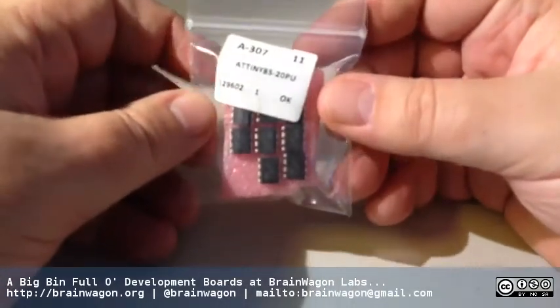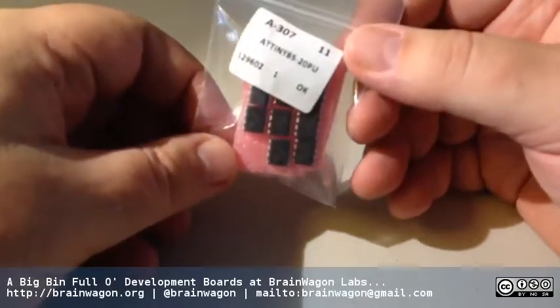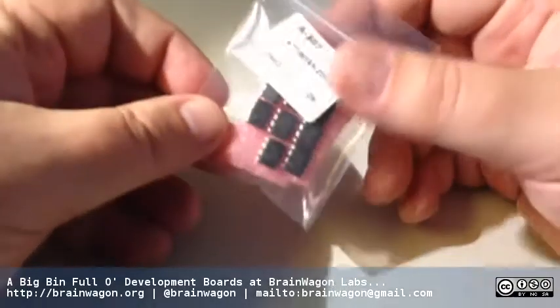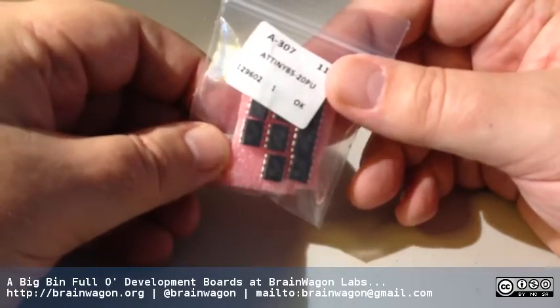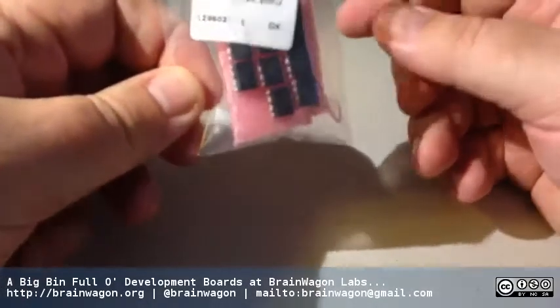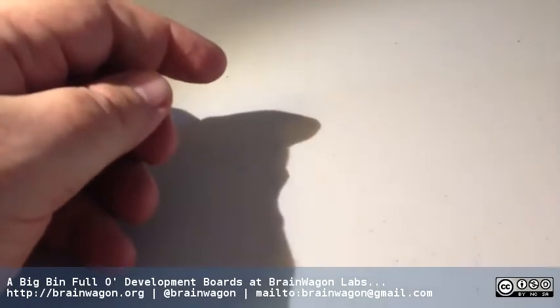This isn't really a board — I keep some of these 8-pin ATtiny chips around. These have 8K of flash and 1K of RAM. If you looked on my blog, this is the basis of my blinking pumpkin and blinking Christmas hat projects. They're a dollar fifteen a piece. You can wire these up without a crystal even for a lot of applications. I use these like 555 timers actually, a lot of the time, just to do crazy things.